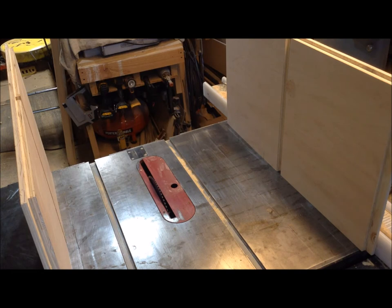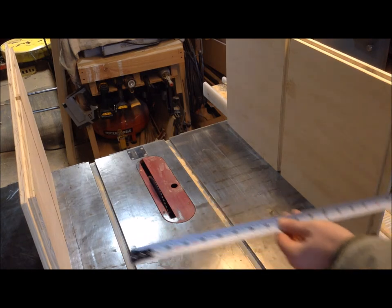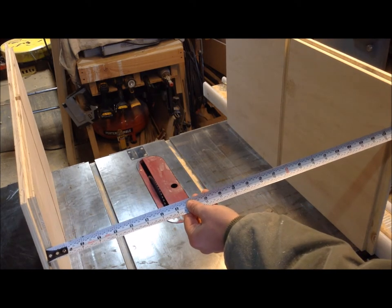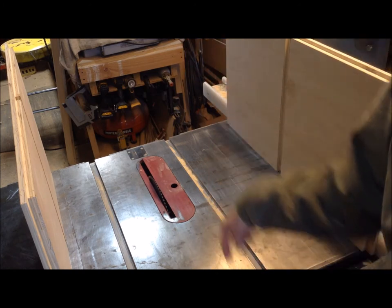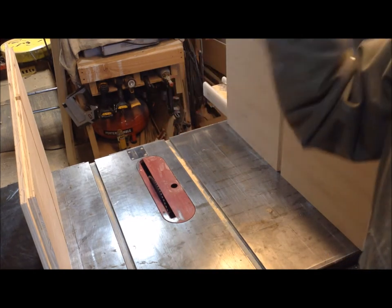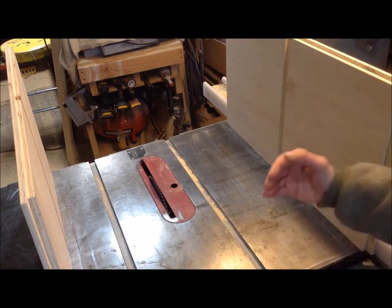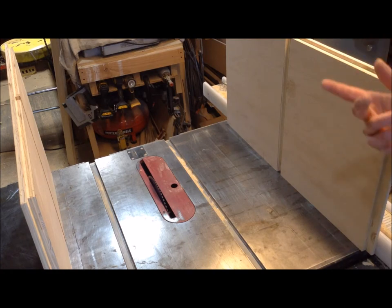I used the same method on the double-wide cabinet to measure for the top and bottom as I did for the smaller ones. I got to where with the center there will be 12 inches for the cubbies. I measured the inside — that's going to be about 25-3/4" — and I'm probably going to round that up to 26, just to give some leeway like I did for the sides. So I'm going to cut two pieces at 26 by 15-3/4" because the depths are all the same. The top and the bottom are going to have to have a dado cut into them to accept the middle piece, and then the middle piece is going to have to have two dados cut into the sides for the two middle shelves. So I'll cut the top and bottom, make those four dados, cut the shelves, and then the carcasses will be done.